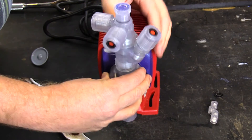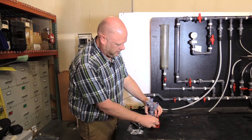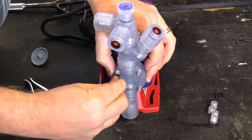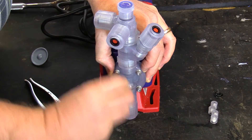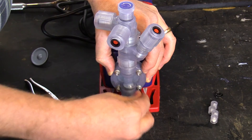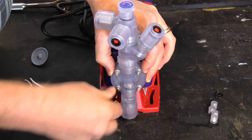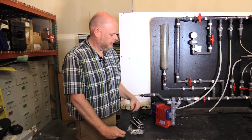Reattach the head to the drive assembly. Tighten it with a three millimeter Allen wrench in a star crossing pattern. And install your pump back into process.